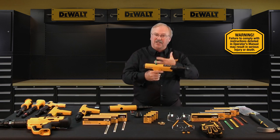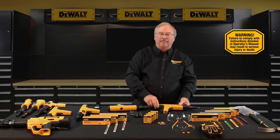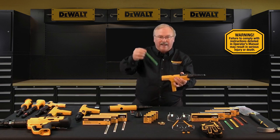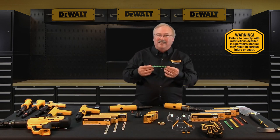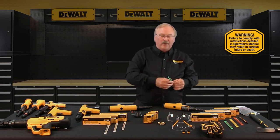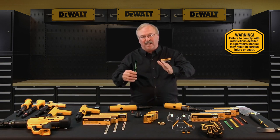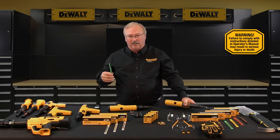Repeat this procedure for all subsequent firings. When the 10-load strip has been completely fired, you can simply remove it by pulling it from the top of the tool body. Once you've removed the strip, check to make sure that there are no unspent live loads still in there. If there are, reinsert the strip and pull the strip from the top, counting the number of times you've passed through a load station — through that process, you can effectively use any and all unspent loads.